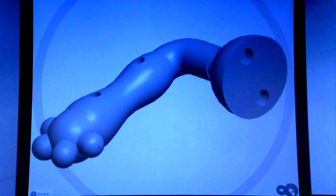All right, next we have the arms. The large circular part is the part that actually goes inside the shell. We do have two holes in that so that the arms are the same for manufacturing purposes. The hole in the inside of the arm is where the mechanism actually attaches. We also do have a small groove in the arm too, and that's where it fits inside the shell and allows it to rotate, but does not allow it to wiggle back and forth.